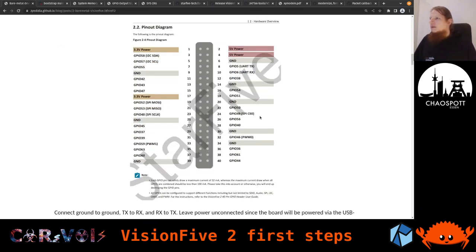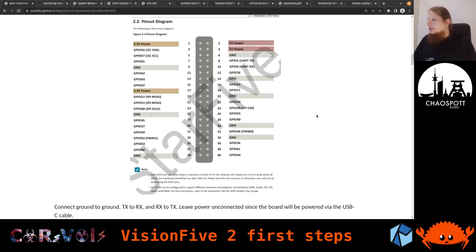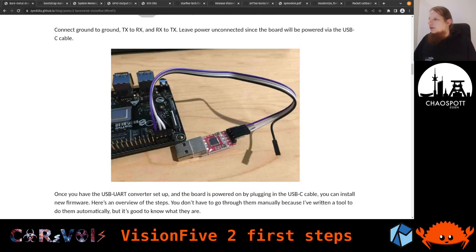For completeness, we have the GPIO pin header. That's where I attach the UART — there is a ground pin, and then the UART TX and RX pins. Those are the ones I connected, and I'm supplying power directly to one of those pins. They are also possible to use for powering the board, and they're doing something very similar in this tutorial.